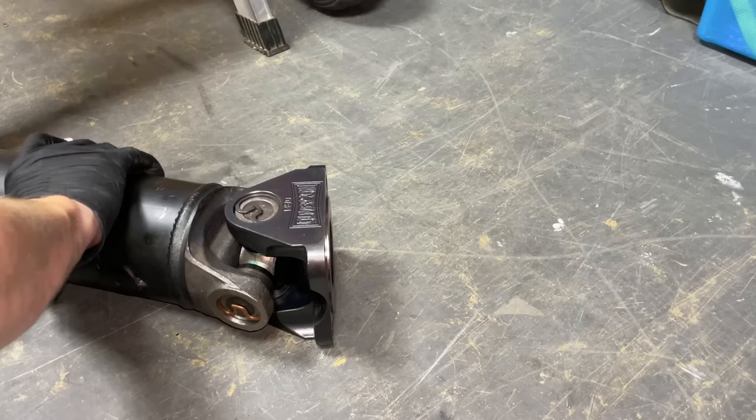And what's this thing going to do? That's the crimper that we're going to use. What does that do? Just how tight the crimp is, that bit? It does indeed, yeah. So what we do is these little dies that are underneath here will get you roughly near the mark of what you need to crimp it to, and then just add on a little bit by the fine adjustment. Sounds technical. Bit of grease. Then we can pop that in the back.